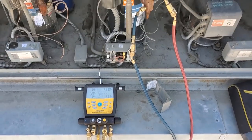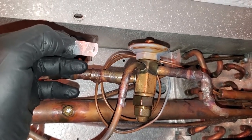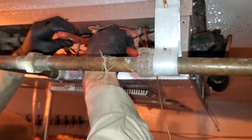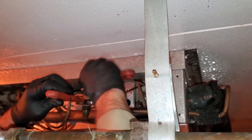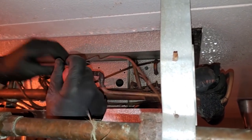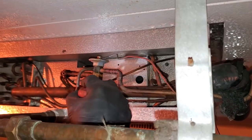So there was a tag that indicated the valve's build on the power head — it says they put a B cartridge in this valve. So we're going to change that power head under pressure. It doesn't work, but I'm tightening it. This doesn't hurt my wrist. There we go. It's broken free.